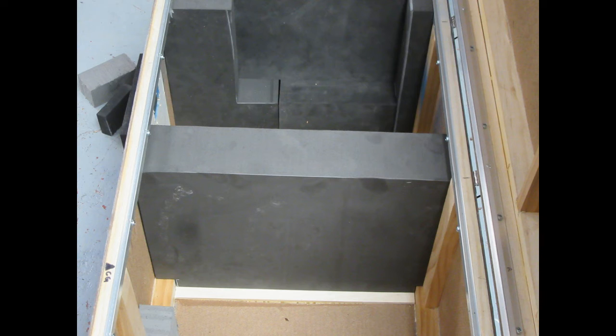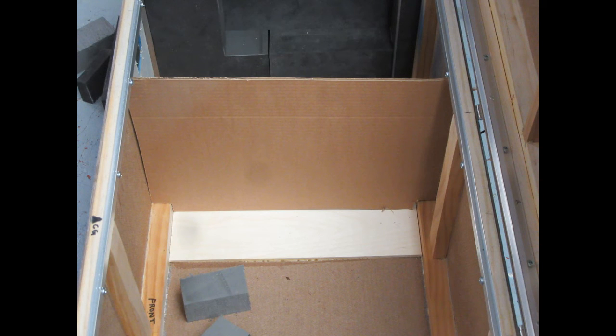Next is the pillow block that will support the upper main part of the instrument. It is intended to rest on the stiffening plywood below and against the front and rear masonite panels. It has been notched to clear the frame in two places and also to clear the edge reinforcing wooden strips near the top. It must fit firmly in position without adhesive, so it takes some work to wiggle it into position. Once the pillow block fits the case well, it is removed and its shape is transferred to a piece of corrugated cardboard, which is here shown being test fit in the case.